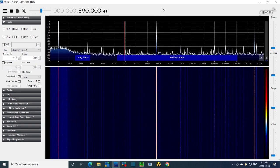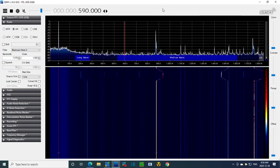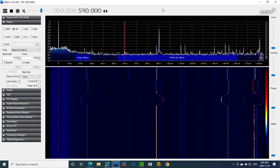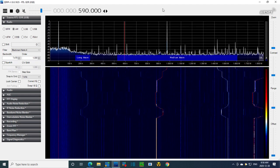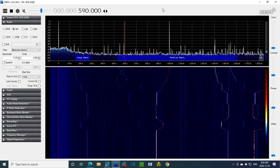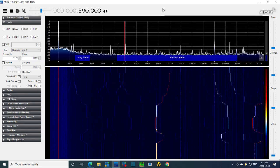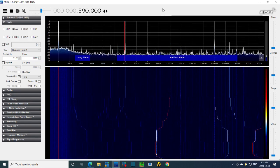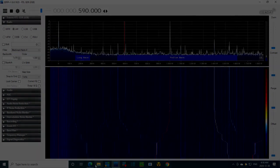Let me tune the radio here and just make sure. And we're doing this with all of 10 volts on the plate. I'm going to turn the tuning thing. Look at that. Beautiful. On the SDR, it looks like a powerful local oscillator. I'll set it to a million. So that's good. So we don't need to look at the SDR for now. Let's go back to the radio.